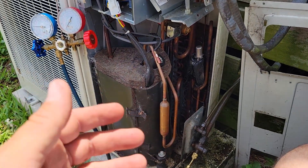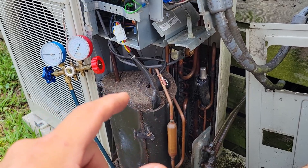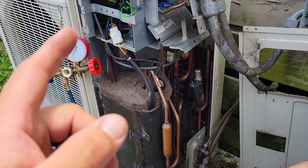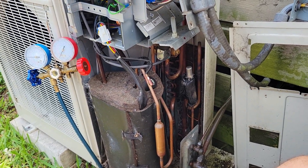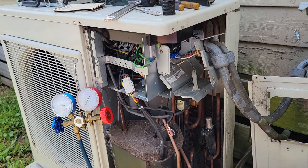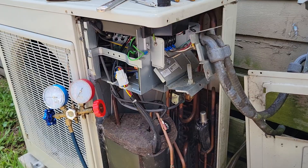It was strange — the coil failed, but not completely. The new coil tested at 50 ohms per side all four times. The old coil was testing 48 and 48 on one side, and the other side was 40 and then 24. So clearly it's not good, but for whatever reason it was not enough to set a trouble code and shut the unit down — it just acted like it was low on refrigerant, which it wasn't. Anyway, hope that's helpful — y'all have a good one.